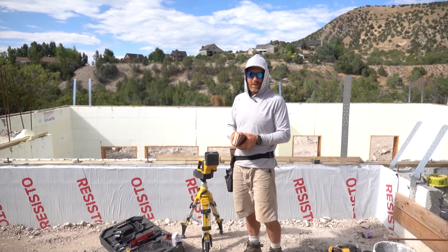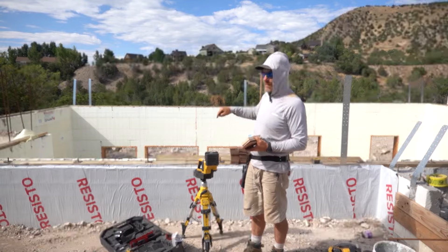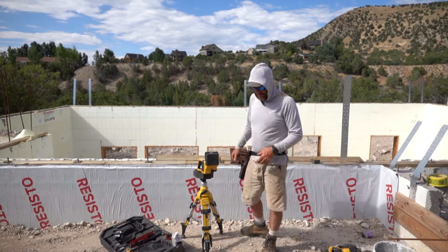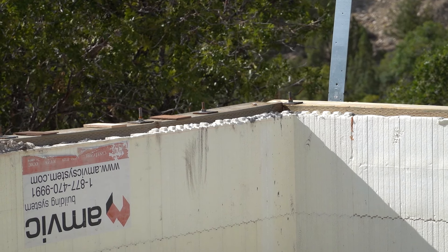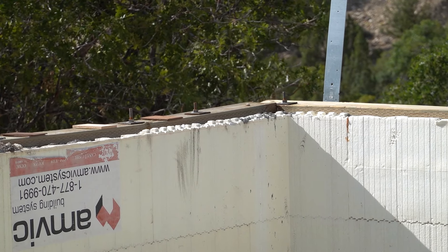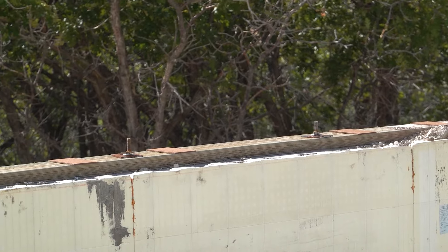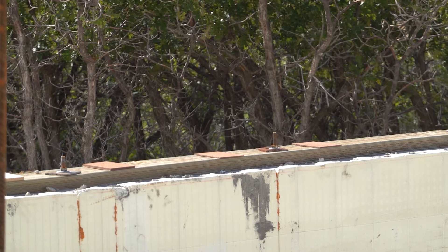When you do a lot of houses, a lot of foundations have big problems — they look really flat but one side of the wall might be a half inch lower than the other. Always get your laser out; if you don't have one, rent one. I just walked around with my laser. You can see some shims are three-eighths, and I just blend along each layout until it's flat. That wall was bad but the rest were a lot better than I thought.